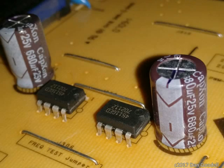This photo shows a pair of good electrolytic capacitors. Ignore the score lines across the top — that's a normal part of the manufacturing process, and it typically takes the form of a single line, a pair of cross lines as shown here, or three radial lines in a Y-shaped pattern, sort of like a Mercedes-Benz logo. These capacitors are good and their tops are perfectly flat.